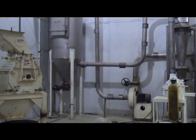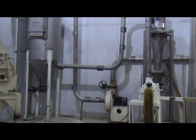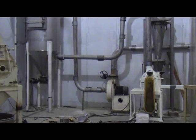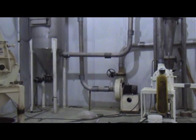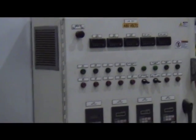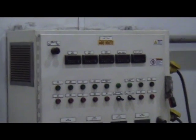The fan and filter are located along one wall, with the mill connected at 90 degrees to the wall with piping and elbows. In most cases, the use of convey pipe and elbows will permit full flexibility to lay out these components in any shape the customer requires, taking into consideration the available space, access to the room, and staging of raw goods and finished powder. Utilizing this type of system, material handling can be minimized, allowing operation by a single person. In a typical production mode, the operator would turn on the system by pressing a start button on the included control panel. This would initiate a sequence of events that turn on all control devices in proper order.